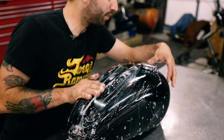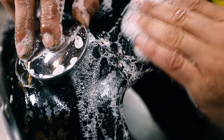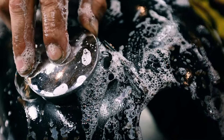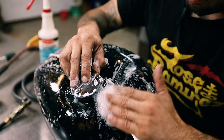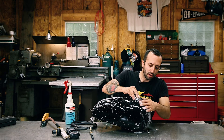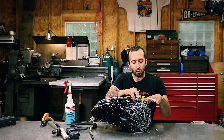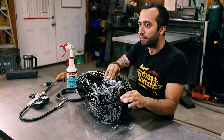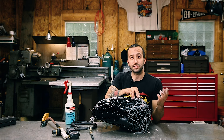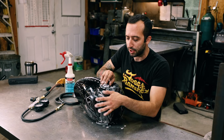We're going to keep looking and it looks like I found one up front. Look at that — see how it's bubbling up. That's going to be on the seam right here. I'm going to have to clean that off and re-weld it. Not all of your cracks are going to look like that — some might just seep a little bit. We're going to cover this whole thing, smear it around so it gets really nice and soapy to create a barrier where it's going to bubble up, because some of them might just bubble ever so slightly. Even leaks like that will cause your paint job to bubble up and be ruined, so you really want to find those.